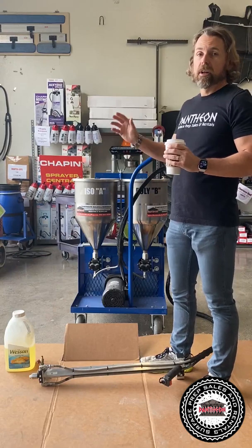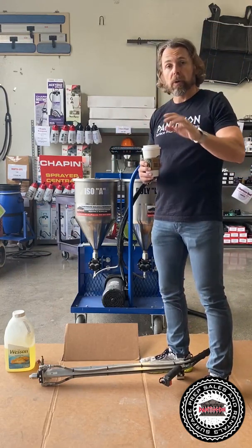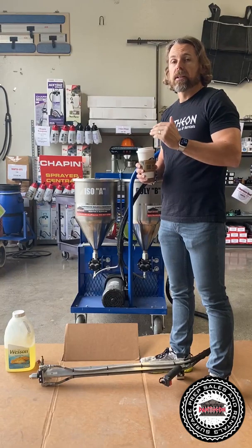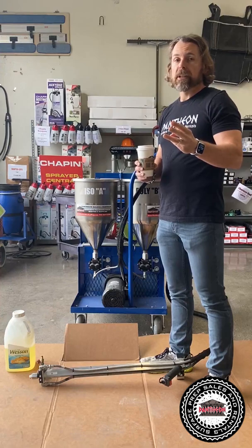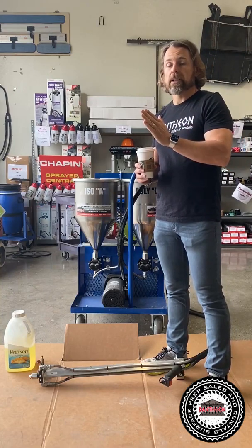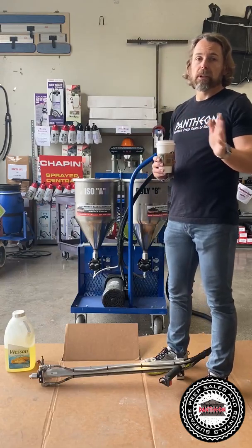And then obviously there's two ways you can clean it. Number one way is what they call a quick clean out. That's if you're going to shut it down on Monday and be right back on Tuesday to pump your material. If you're gonna wait more than 3 days, you should have a complete clean out, okay? So if you shut down on Friday and come back on Monday, you can do a quick clean out. But if it's gonna be a 3-day weekend, you really should do a full clean out and call it good.